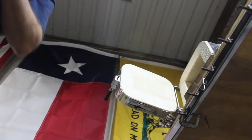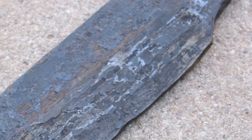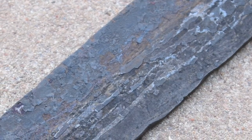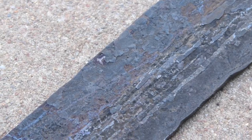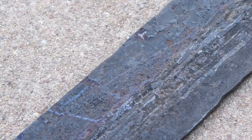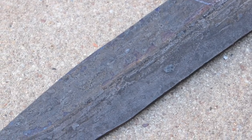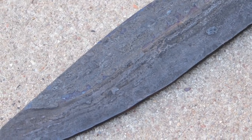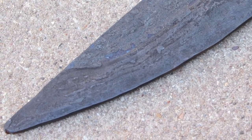The one thing I noticed coming out of the quench is it curved slightly toward the edge — the edge steel contracted a bit more — but that more or less corrected itself as the blade cooled and after the temper it's hardly noticeable. There's our forged blade, guys. You can see some of our 15N20 sawmill blade steel lines in there, and up at the top on the left that's all wrought iron, which is going to have a really cool grain to go with our pattern weld. I haven't seen it etched yet but I'm really excited. That's it for today — I appreciate you watching, and we'll see you on the next video.